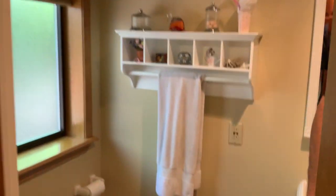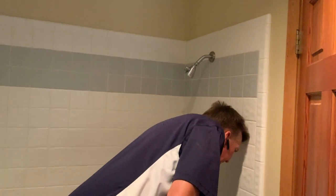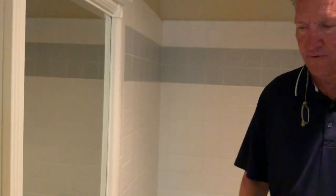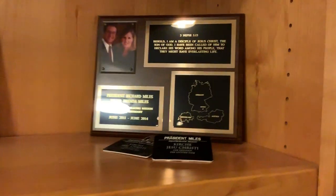Yeah, there we go. On two of your bathrooms, you've got diverter issues. A diverter is on the tub spout. It sends water up to the shower head. Half the water still comes out through the spout, and it's a case of taking care of the spout and the diverter. Other than that, notice the faucets, the elegance they've gone for. I don't know if their plans are to turn this back over to a bedroom or keep it as a formal office. But all the built-in cabinets, everything is a match set.